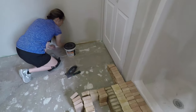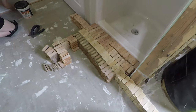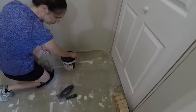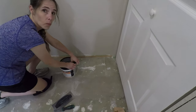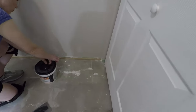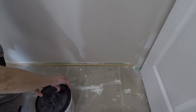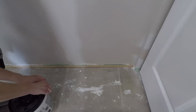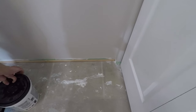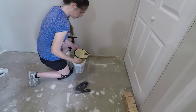We've never done this before, but we're going to try. We've got all the 2x4s cut up to a half inch width and we're going to use furring strips cut down into small pieces as a guide for our expansion joint. We'll butt right up against that with our wood slats and then pull that out when we're done to give room for expansion. So here we go — wish us luck.